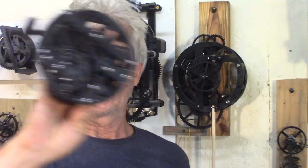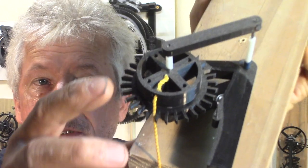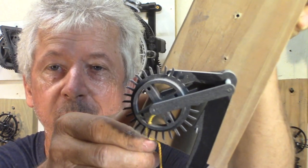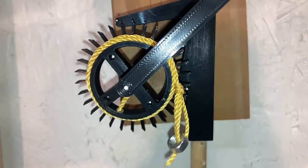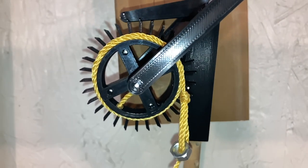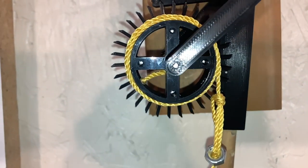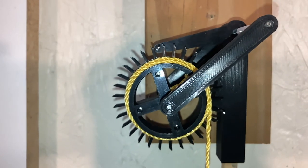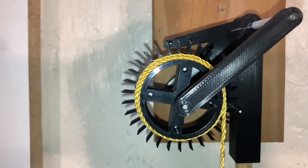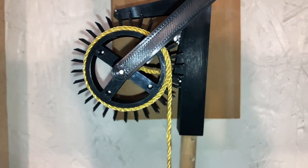After doing this Roskopf watch, I found that using pins for the escapement was pretty good friction-wise. Here we can see an early test — you can see it's using a metric 6 nut that's 2.5 grams to pull the escape wheel. That escapement looked like it was working pretty well, so I decided to go ahead and use it in a clock.